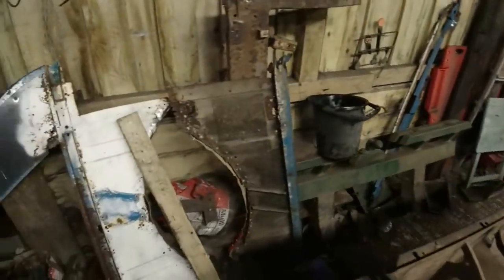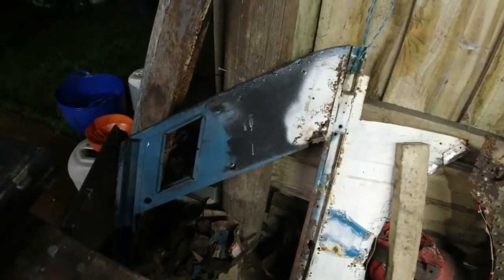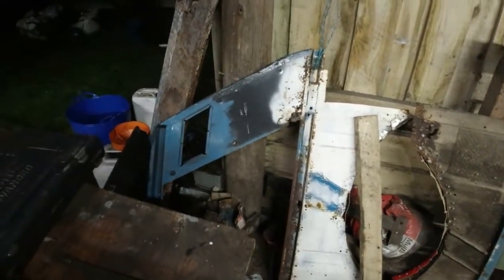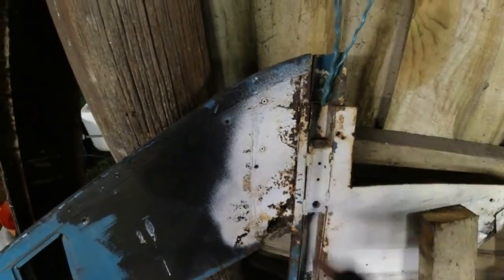Yes. I've got some panels over here that I need to salvage, so I need to salvage the D-post off that. Because I need to understand how the roof section splices in between. So really what I'm going to need to do here is properly chop like that and like along here. And then really just attach that onto the tail end of the inner wing.